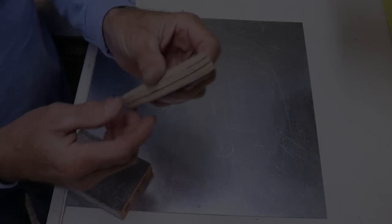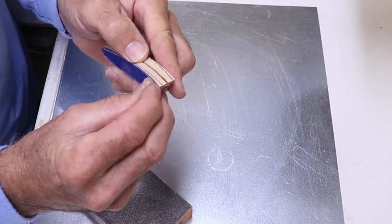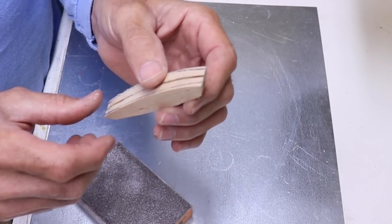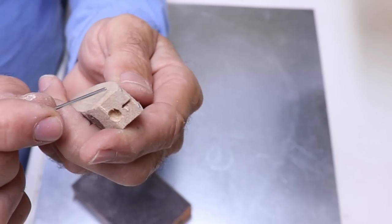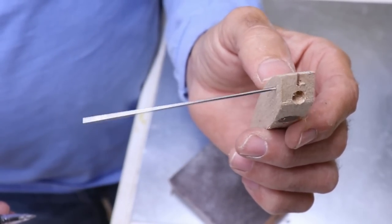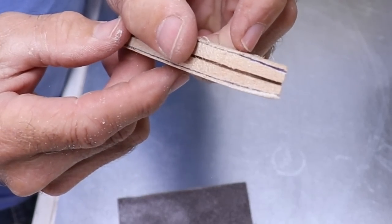To shape this thing and get that contour from front to back, I'm going to use a block of sandpaper. I don't really want to take this to the sander because it'll be a little too aggressive. I've poked a little hole right where I'd drawn the eye on the blue tape. To transfer that spot to the other side, I poke a piece of wire into the hole — this way I can sight both on top and in front, align it with the pin, and make a mark on both sides to be sure the eyes are aligned.